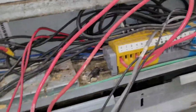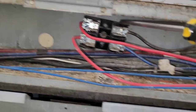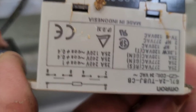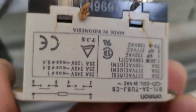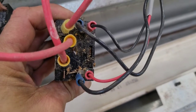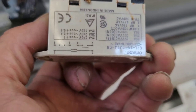Power comes in — we have big lines coming in here, this is three-phase 240 volts. Two of the phases go into these fuse holders; I've got the fuses right there. So I've got hot power coming in here, and then the fuses bring them out to these red lines. These red lines go into this relay. Look at the diagram on this relay — terminals zero and one are for the coil, and on the left side you have terminals two, four, six, and eight.